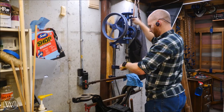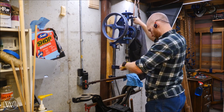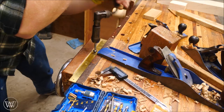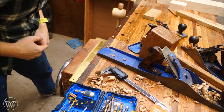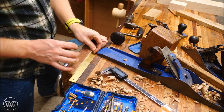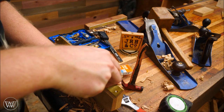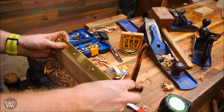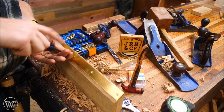Here I get to use another favorite tool — the beam drill, or post drill. It's an enjoyable tool designed for drilling through metal, and I did a restoration on this one a while ago. Then I bring it back over and countersink where the screw heads will sit so they're nice and flush. A good countersink bit is a very hard thing to find — when you can find it, hold on to it and mark it. Then I use my Jared Hildebrandt awl — Jared is another great channel to check out, and he gave me this awl about a year and a half ago.